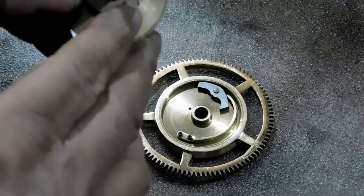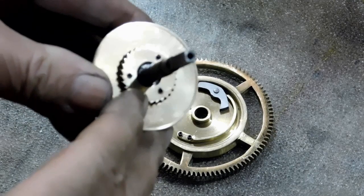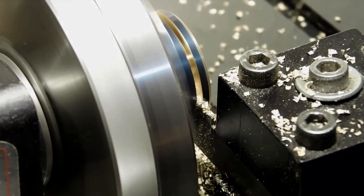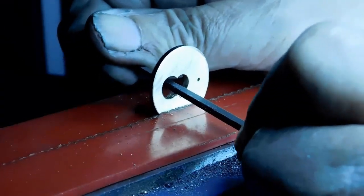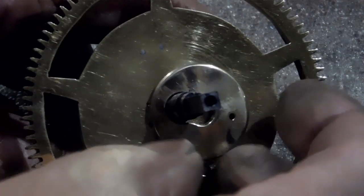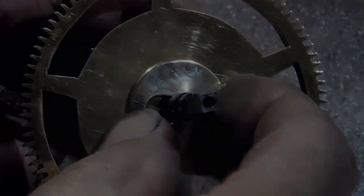Here you can see I've made a change — I've put the ratchet right on the back of the fusee so that we can ratchet it around and connect it directly to the great wheel. Now we need a stop button to put it all together — this will lock the great wheel onto the fusee. Once it gets in here and locks, that little hole is for a screw to hold it so it can't move. There we go — we've got the fusee and the great wheel together.